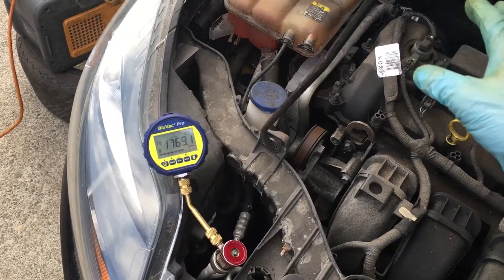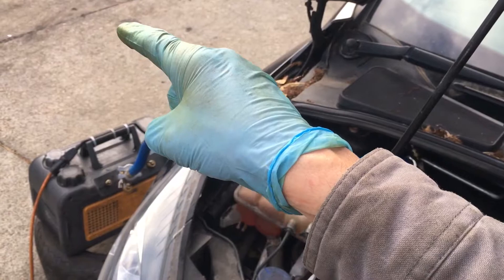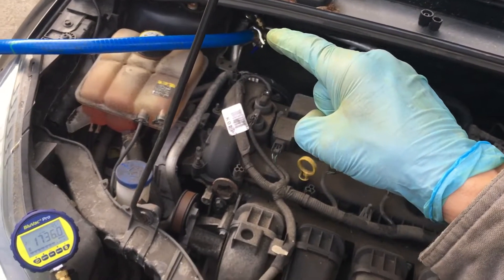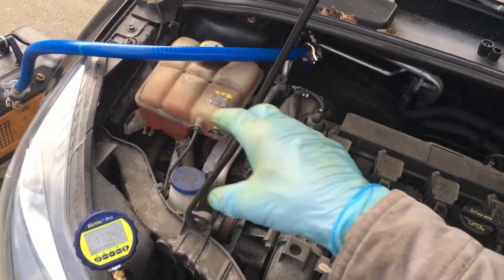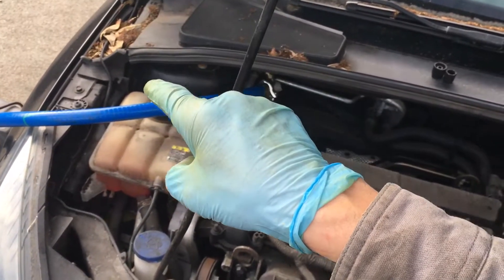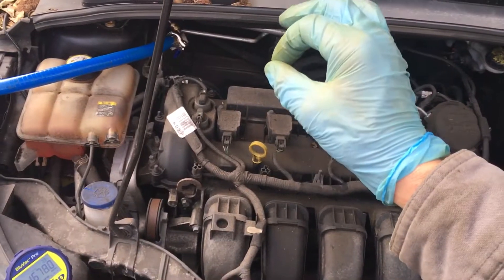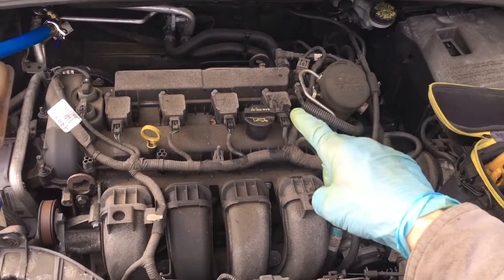If you had a completely dry system and you were drawing a vacuum and graphing it, you'd see the micron reading start way up at say 2000 microns, then a nice steady slow line going down — leveling out as it gets harder to pull lower. Compared to a wet system graphed out: you'd see it start at 2000 microns, then pop up, go down, pop up, go down — constantly doing this for minutes or even hours depending on how wet the system is. Eventually it reaches equilibrium, there's no more moisture to remove, and you'd see it start to drop again and stop doing the little spikes.